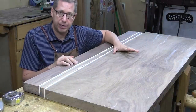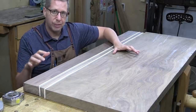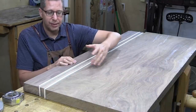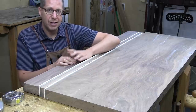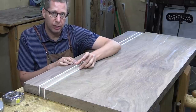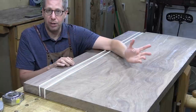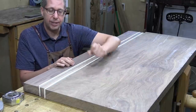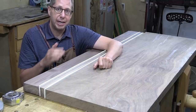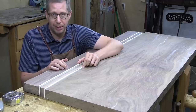So now you can see kind of the finished product I was going for. The holly is a stark contrast to the dark brown walnut, so it kind of acts as like a reset button. What I wanted to do is give the idea that I had one solid slab. And if you look real close, you can see that the grain obviously is not the same as you move across the holly lines. But the brain doesn't really care — it sees that holly and it resets and starts over past it. In fact, because there's such a stark contrast with the holly, that's the focal point of this top. Your eye is drawn to that, and as far as the brain's concerned, it's all one bit of walnut. The walnut is the background to the holly that pops. So I'm not hiding the glue line — in fact I'm making it very obvious. Here's the glue line, and because of that, nobody else really cares. You're kind of hiding the fact that it's not a solid slab in plain sight by throwing that punctuation in there.